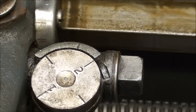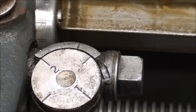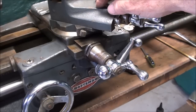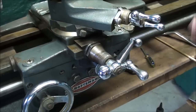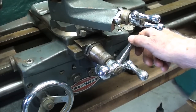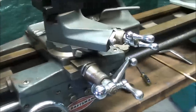Read about that in your book — there's a good section on that. Now I'm not going to be cutting yet, but the tool is not in contact with the work — here's what my hands will be doing. I'll have the cross slide set on zero, and I'm going to be watching the thread chasing dial. When it comes onto a number or a line, I will engage the half-nut lever. When the tool comes down and into the undercut, I will release the half-nut lever.